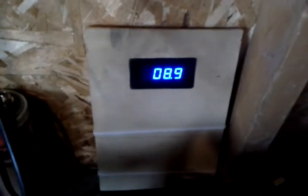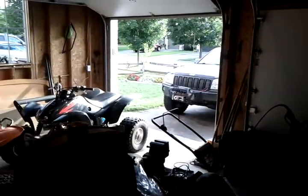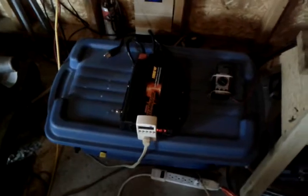Right now my batteries are at 12.8 volts — they were at 13 a second ago, so putting the load on the system dropped them a bit. We are still charging a little from the sun, got 9 amps coming in. It's a little bit sunny, still not very sunny, so we'll see how it goes and I'll update you on it.